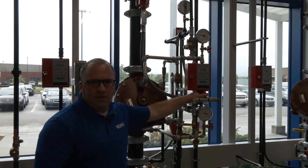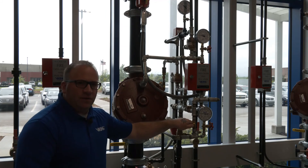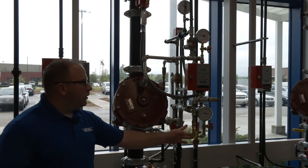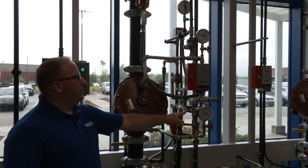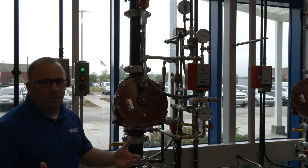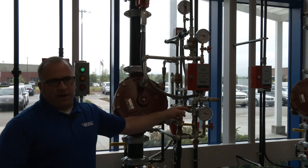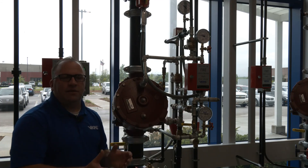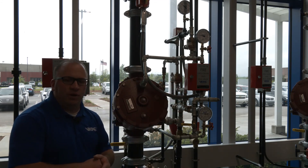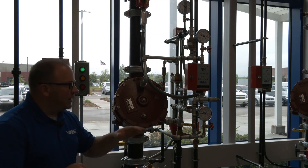In this case, we have that half-inch ball-style valve that's located over here, and it's got to be in the open position in order to receive that signal. We're going to activate this valve to test our PS10 water flow switch, and we'll get our water flow alarm to our panel itself, and then we're going to close this valve. As we close this valve, our pressure is going to pass through the drain check here, and once that pressure is relieved off the PS10 flow switch, our panel will clear. That pressure is going to drain off through the drain check valve itself, which is noted by a red sticker on the top that says drain check - essentially a check valve with a small pass-through that allows that pressure to bleed off. If you operate that valve and can't get the water pressure to relieve off of the PS10 switch, it may be because there's debris in the drain check valve, preventing that pressure from being relieved and resetting the PS10 switch.